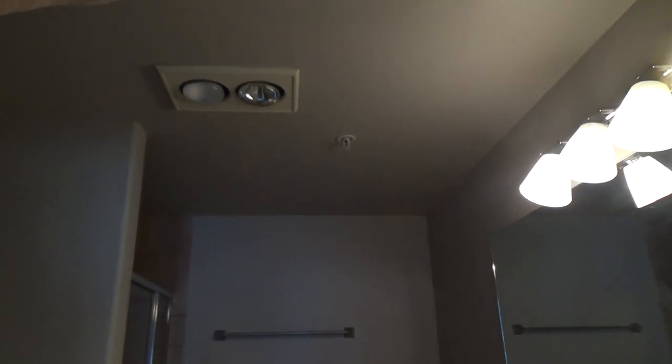Before I start painting the ceiling, hear me out — you're going to learn something here. You can see how the color of these walls are tan and the ceiling is tan. When I get done I'm going to have it look like this other bathroom I've already done, with white on top. I'm using white semi-gloss for the ceiling, and semi-gloss — not eggshell — on the bathroom walls too, because it's glossier and wipes down and cleans up easier.